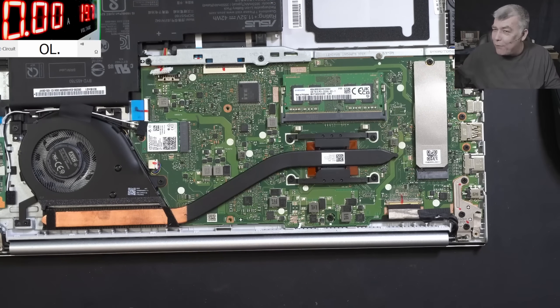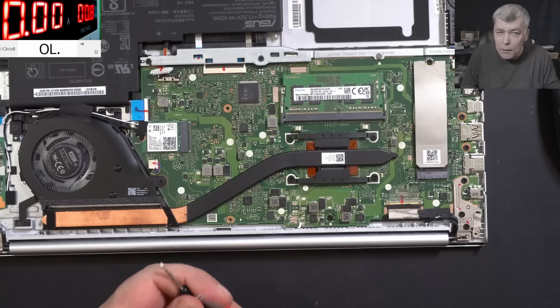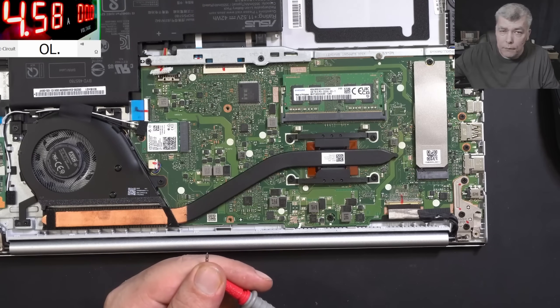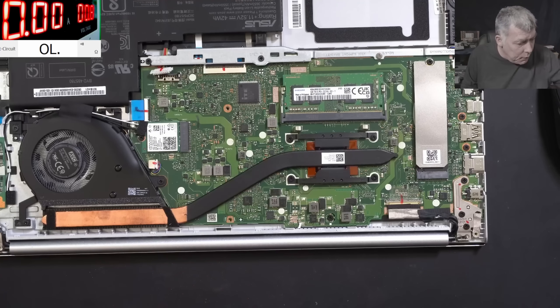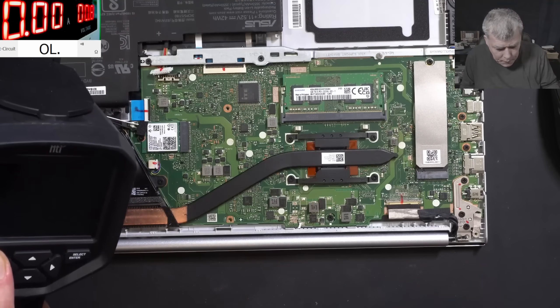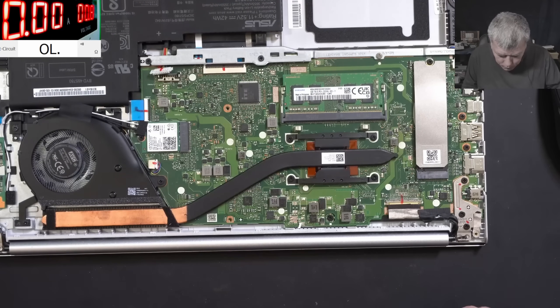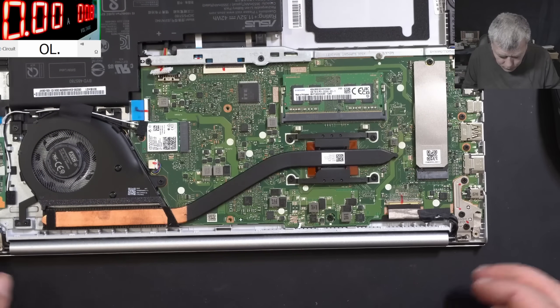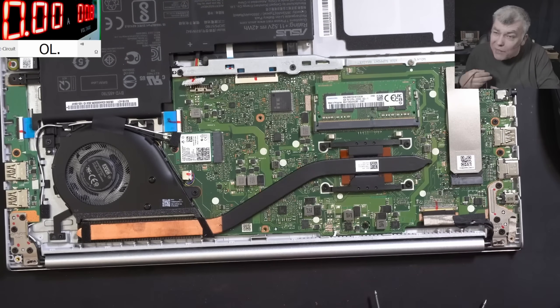I just started the video and I feel like I have to end it. So let's lower the voltage on the power supply - like 0.8 volts. That should be fine. Let's lower the current too. Let me grab the thermal camera. So basically the main power rail is shorted. You can check the main power - you can see, check here, check here, check here.